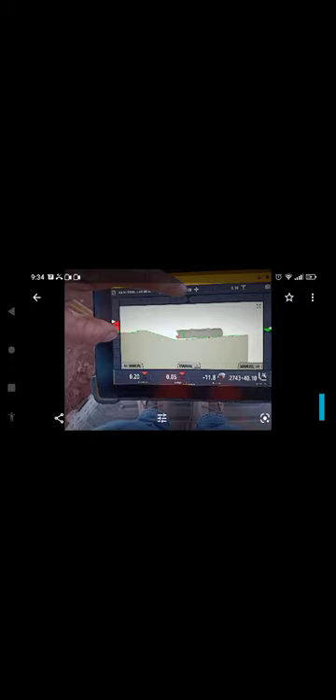I've noticed there's very little information online on how to use Trimble Earthworks Volume 2 for a motor grader, so I'm going to explain what I've learned. First, we're going to talk about a horizontal offset, which is the coolest thing on this new system. You would choose where my pointer finger is — that's your horizontal offset. Press and hold that, and it will open up this screen.